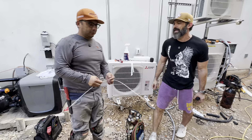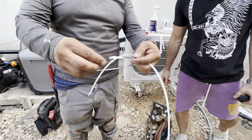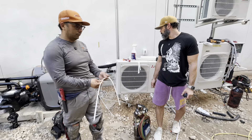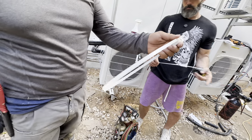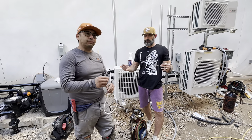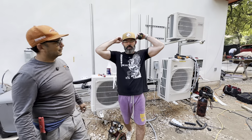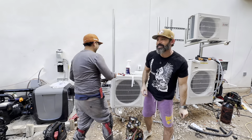You've got those tie straps — these are the type you want to use. They're stainless steel, from the uni-clamp system, and basically these do not deteriorate from UV rays compared to the standard duct strap, which could fade out in maybe six months to a year. So these are what you want to use for wraps if you're trying to support on this type of system.